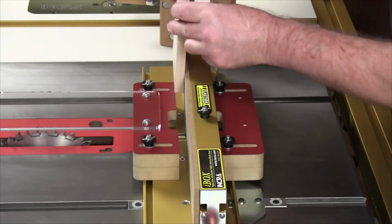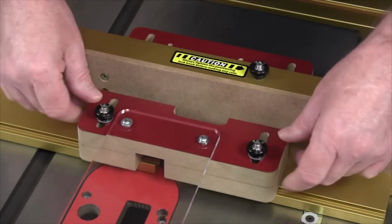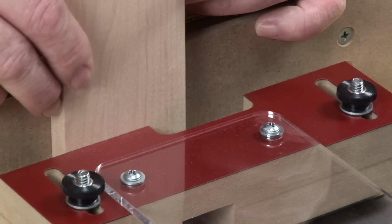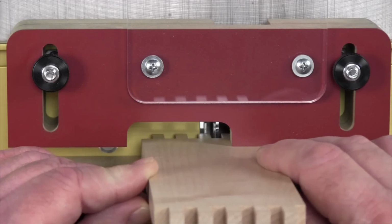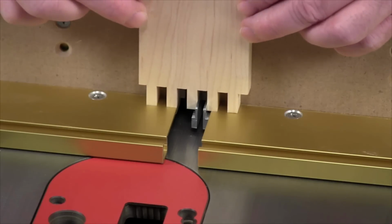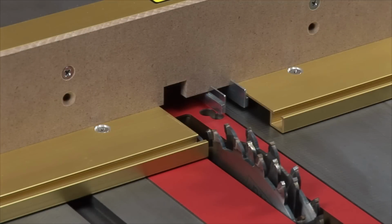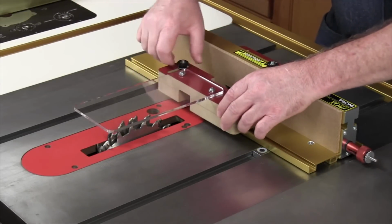The front guard doubles as a vertical stock support and is adjustable to provide support for material thicknesses from 1/8 to 1 1/4. The U-shaped view cutout on top allows the operator to easily see the engagement of a previously cut groove over the positioning pin plates. The forward-mounted stock ledges provide optimum support for your stock on both sides of the cut. They are adjustable in or out depending on the cut width and pin plate positions, and include a T-slot for locking down the front blade guard.